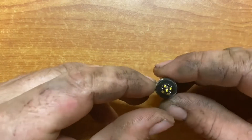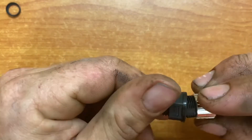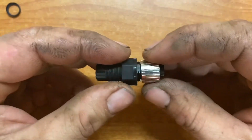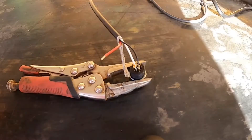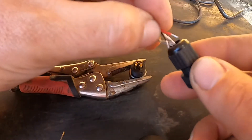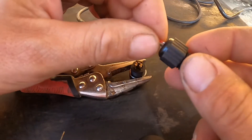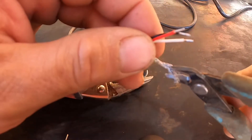This is a female one that has solder-on points for your wires at the back. They make male and female connectors in both styles, but we're going to be using one of each in this video. Take your wire and feed it through the compact screw that seals the plug off when you're finished.